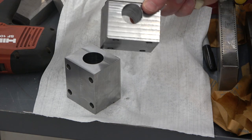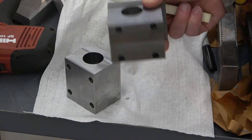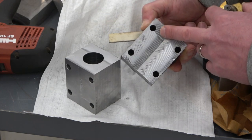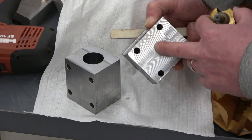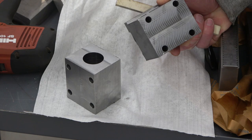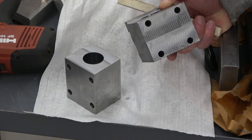The first thing I done, I did the orientation wrong. You see the bore is in the wrong spot. But also came in real hard and heavy with the face mill. You see how hard that was. Now, that tool will handle that, but the fixturing, as we saw, wouldn't. Popped right out. That kind of gives me a bit of a pucker factor there.